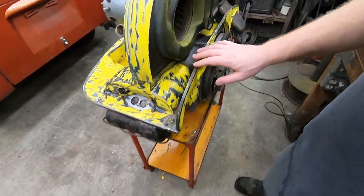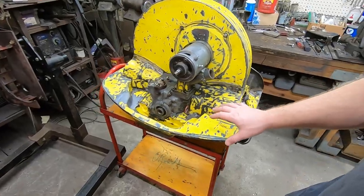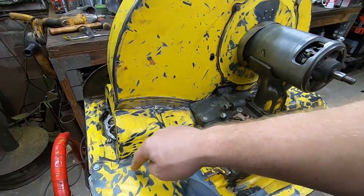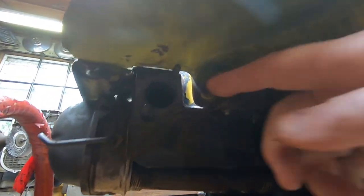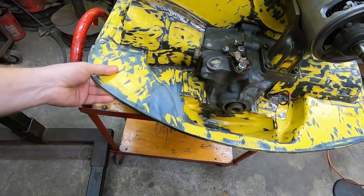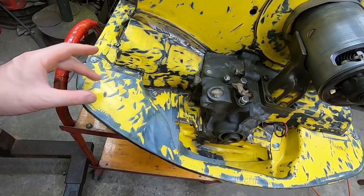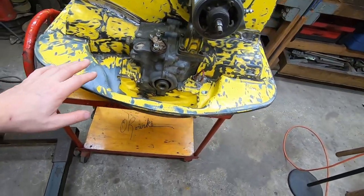Right now, it makes sense to finish all of this before we get into really heavy surgery that's gonna be happening up here. To get this heat riser in, we're gonna have to make some holes that the heat can rise through. They'll be connecting to the exhaust stacks. And so this cooling tin was not made for that, which is too bad, but we'll cut this open. We have to make some covers, keep the hot air down there and inside the tube. And there's some crazy stuff that's gonna go on up here.